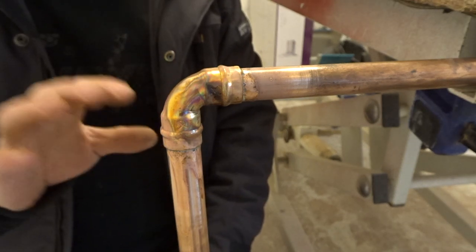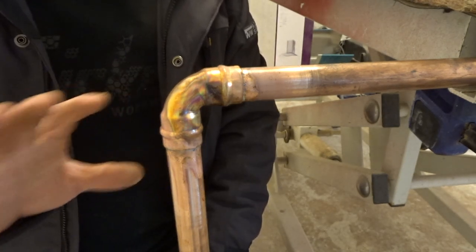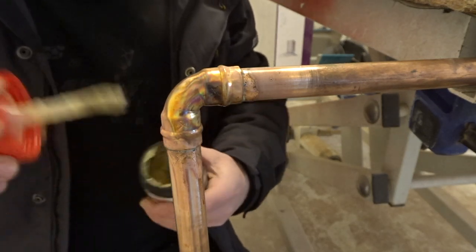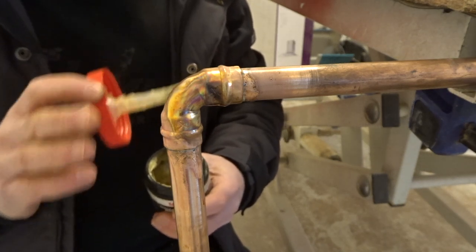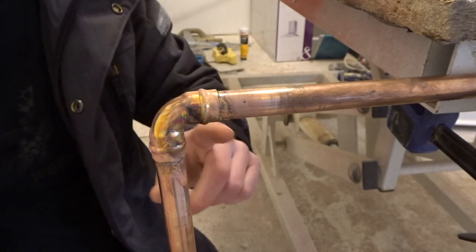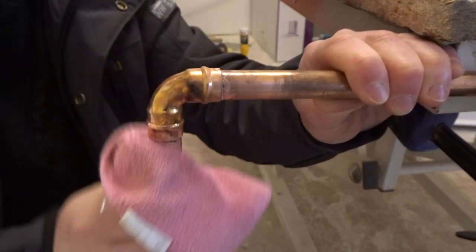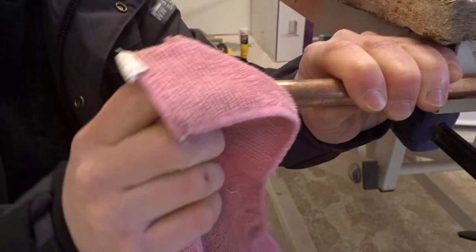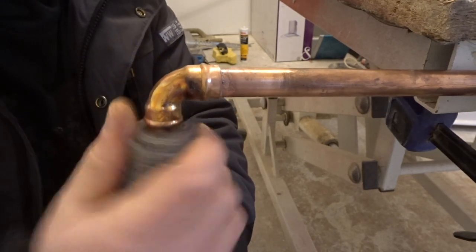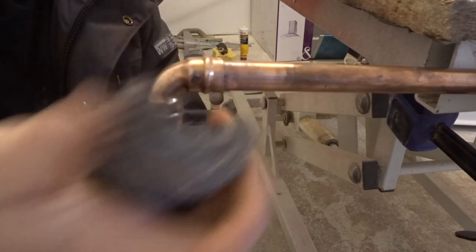We're going to leave this to cool for a few minutes. Don't wipe this with anything or touch it because you're going to burn your hands. Do not dip it in water or spray it to try and speed up the cooling process because you can fracture the solder joint. Also, some plumbers will clean that joint up whilst it's still very hot — that can also cause a fracture on the joint, so I don't recommend doing that at all. Now our joint has cooled down, just give it a wipe to remove any excess flux, because that's corrosive and we don't want to leave it on the pipe. Grab your wire wool and give it a clean up — that'll get rid of any heat marks and any flux on the joint, and it just looks much prettier.